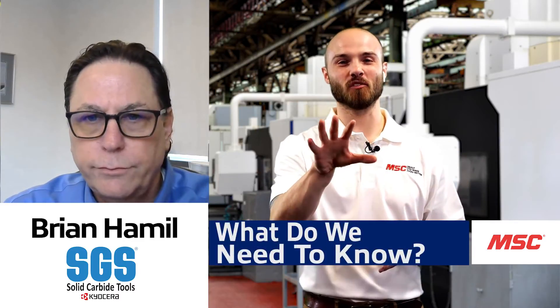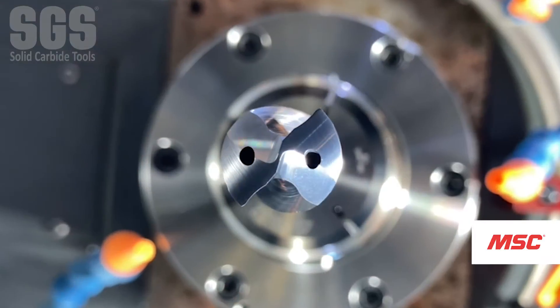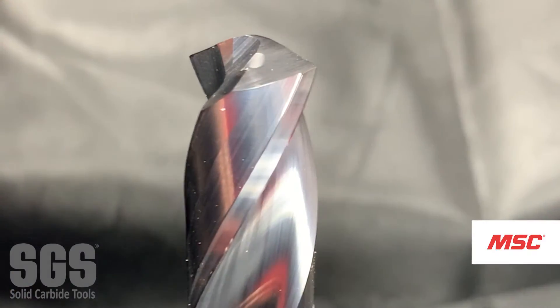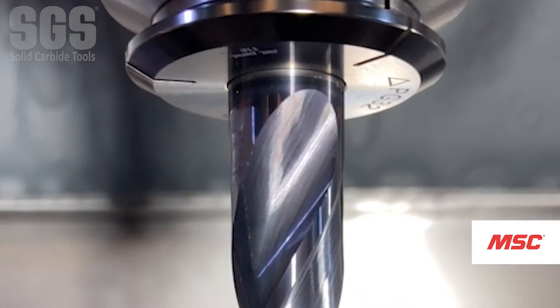When it comes to the 143MS, there are clearly lots of specific features on this tool. The '14' stands for coolant-through. The 'M' and the 'S' stand for the ISO designation of material being stainless steel and high-temp alloys. So the series designation 143MS is a material-specific geometry that we've developed, and it's a coolant-through tool for those kinds of applications.